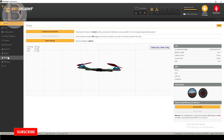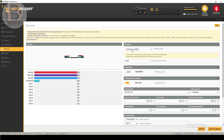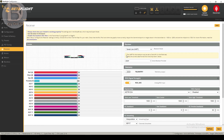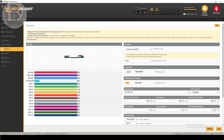Next, in the Receiver section, select the receiver type as Serial via UART. Then select Crossfire as the protocol. ELRS receivers communicate with the flight controller using the Crossfire protocol — if you were using other receivers you might select IBUS or SBUS, but for ELRS we use Crossfire. Save and reboot. Make sure your ports have UART serial RX enabled for the receiver. Now it is ready to flash firmware using the Betaflight passthrough method.